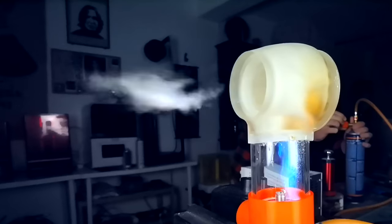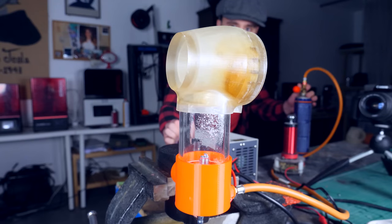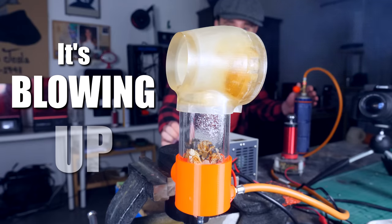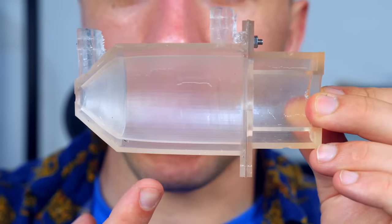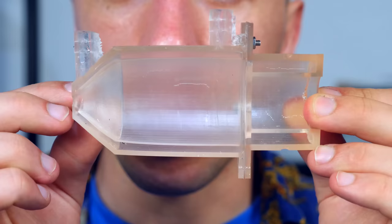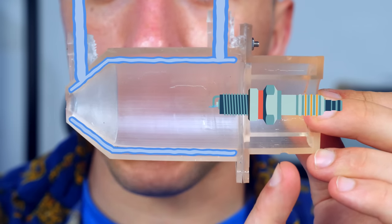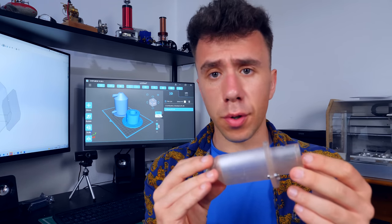For a while now I've been trying to 3D print a jet engine in plastic, which is not a great idea since the result tends to be the same. But what if, with some clever design, I was able to use water to cool the engines and make them not melt — just like this balloon? This is my very simple idea: I want to 3D print a combustion chamber with a hollow space all around it so I can pump water through it. Then I'm going to inject butane gas and air into the combustion chamber and use a spark plug to ignite everything. If this works as well as it did for the balloon, the engine should survive. So let's 3D print it.